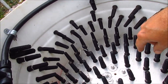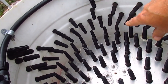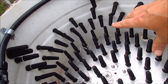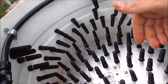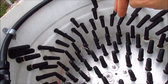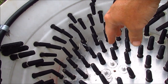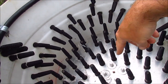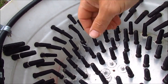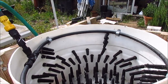The bottom piece is the feather plate. This is another item you can buy, but I drilled all the holes myself — I didn't go with the standard pattern, just went every other rung splitting the difference, and it seems to work fine. The last piece, which you can't really see, is the drive axle. I did buy that piece since it fits everything else, and it basically just bolts right onto the plate and makes everything spin.